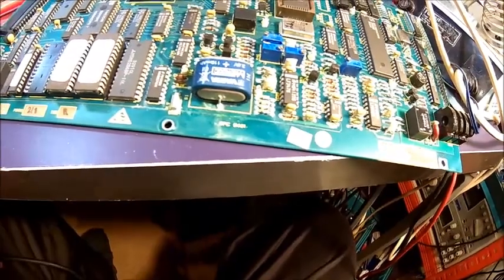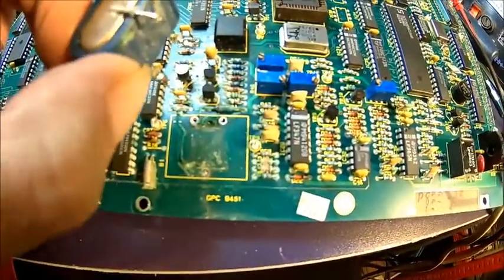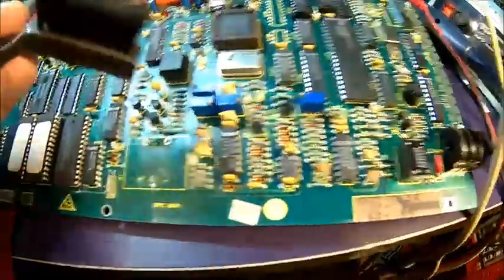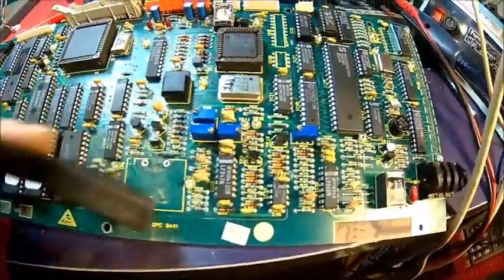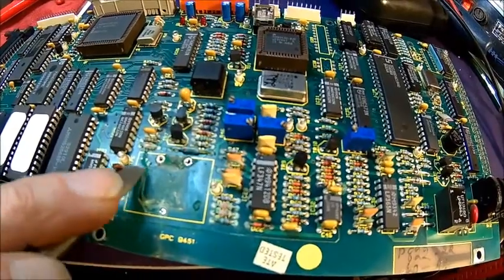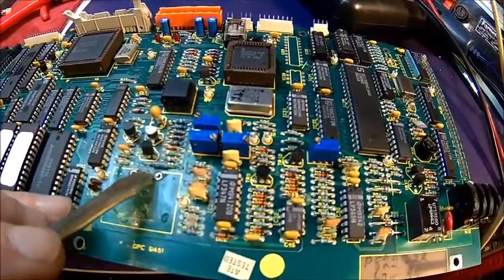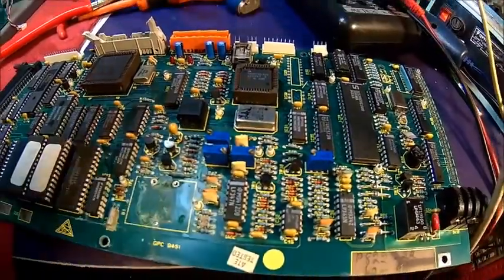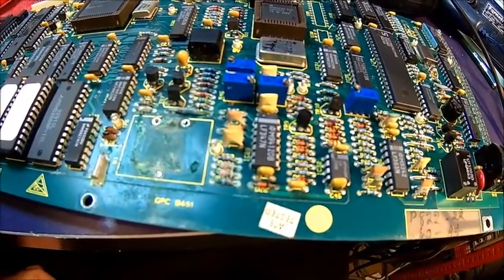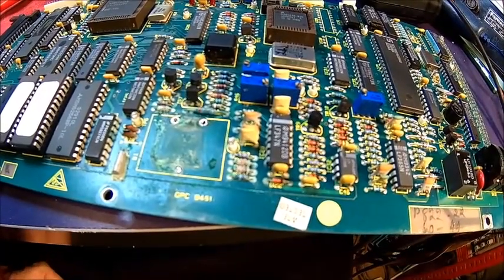Let's get it out and see what we can rescue. It's completely drained. There are some tracks here — I'll use a carbon brush — but this track is probably done, it's eaten up. It did get some charge when I was running it but this stuff is not healthy either. Anyway let's clean that as good as we can and then we'll see what we can do. We could probably fit a gold-cap supercapacitor — one of these high-capacity electrolytics, 5V, 1 farad or so.